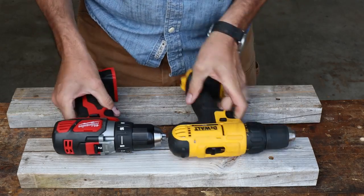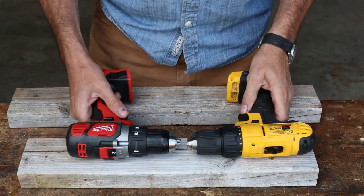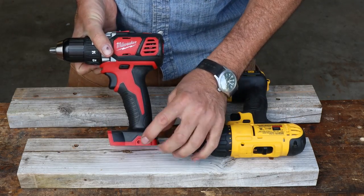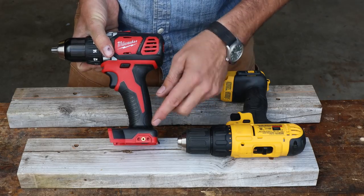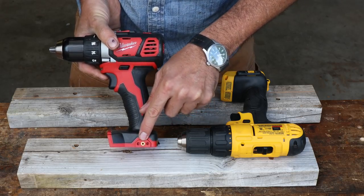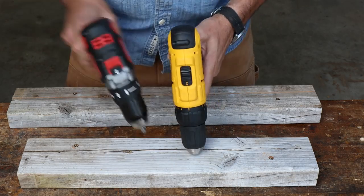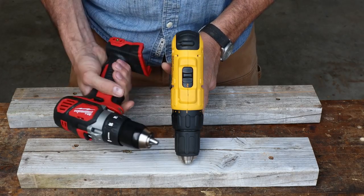I'll start with the Milwaukee. Just looking at these — I'm not a super tool expert, but I am a user and I've used them all my life — just little details in the Milwaukee that are kind of nice, but that's kind of to be expected because it's $50 more. We've got what looks like a metal chuck on the Milwaukee and maybe a plastic one on the DeWalt. One thing I noticed: if you're going to pay $150 for a drill, is it too much to ask to put a little stainless tool belt clip on there? I have that on my Makita and I like it. There's no clip here — you can see where it looks like it goes, there's a nice brass insert. On the DeWalt, I'm assuming this is for a clip, and it looks ambidextrous — goes both sides — but no insert, it just screws into the plastic. One thing I really like about the Milwaukee is it's more compact — must be a little over an inch, inch and a quarter shorter. That's really nice for tight, confined areas.